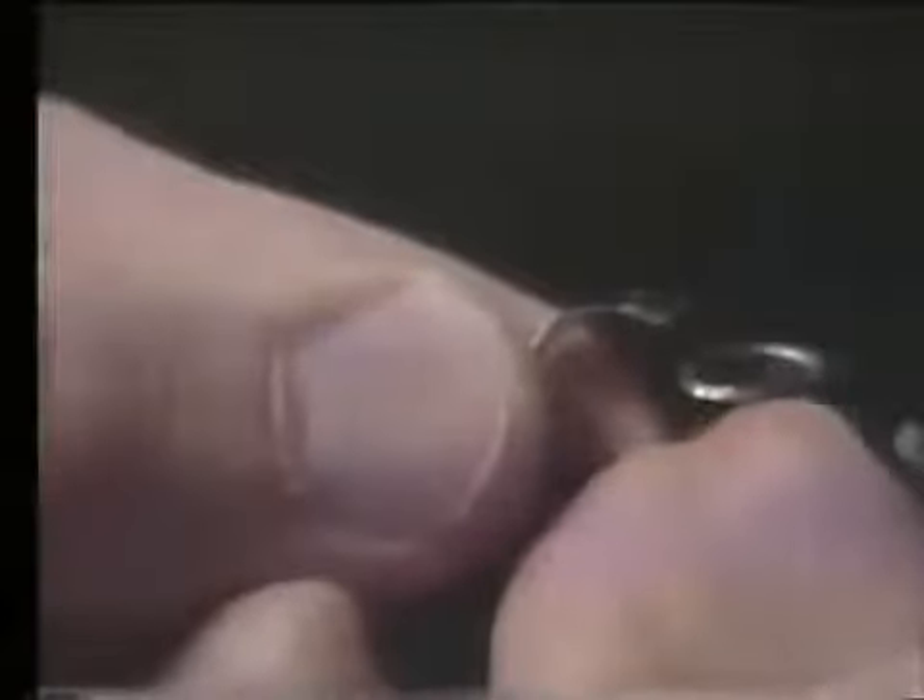When the solder has flowed — and you can see it flow all the way around the tube — you remove the band from the flame and inspect your solder joint. You want to be sure that solder has flowed completely around the tube, with all the edges of the tube joined in a smooth, continuous solder joint to the band. Also, you have to be sure that no solder has flowed down into the tube, to prevent interference with the precision fit of the mershon shaft down in that tube.